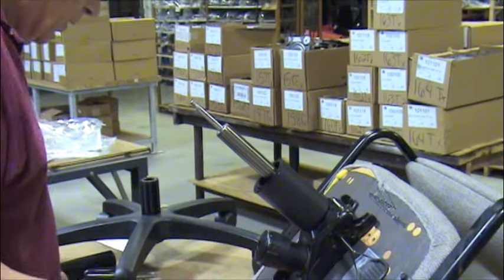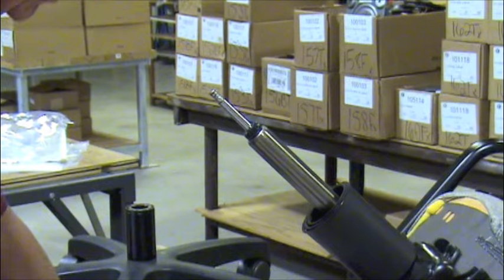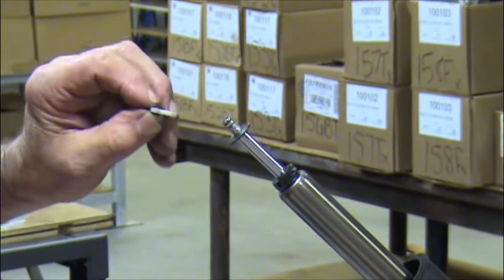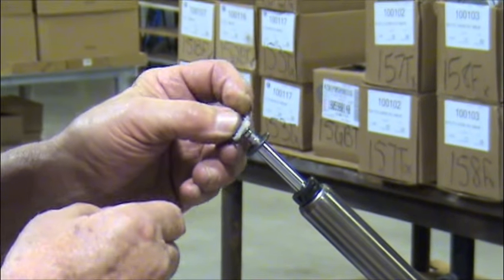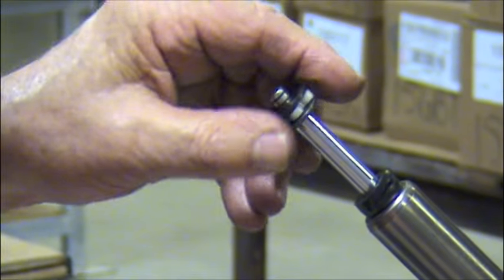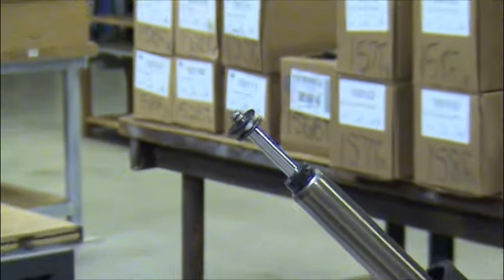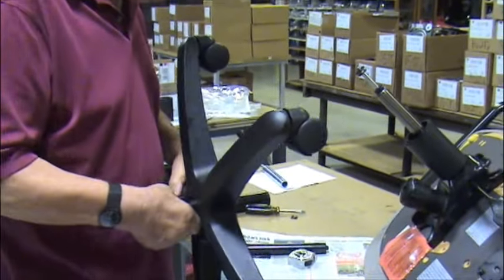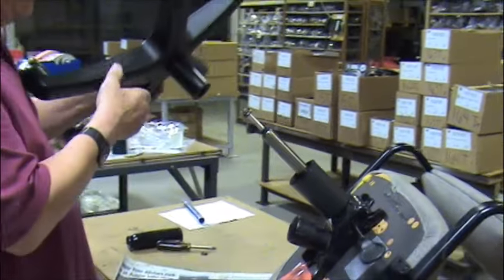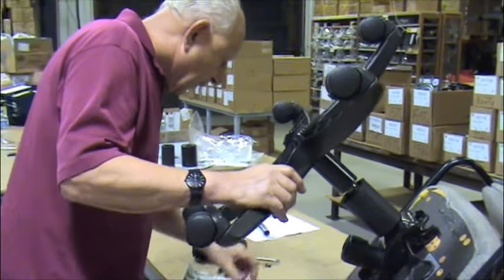So I put the telescope cover back on. I'm putting the few broken parts back on. Look at that bearing race — one ball bearing is missing even, and this is all groove worn. I'm taking the chair base. And don't forget, this is the column — it is not the gas cylinder. This is the gas cylinder body. A lot of people make that mistake. I'm putting the 5-leg base on.